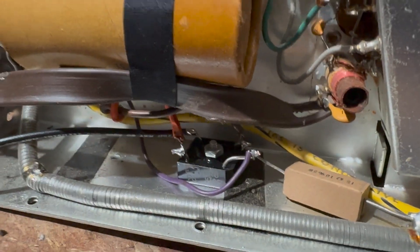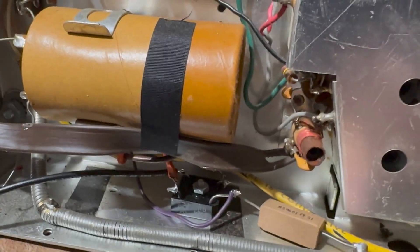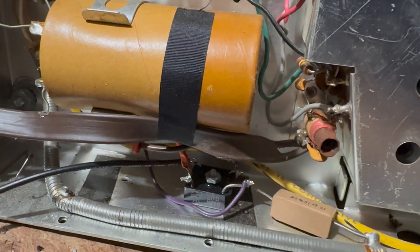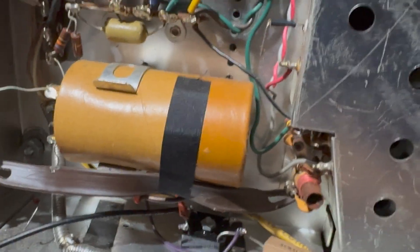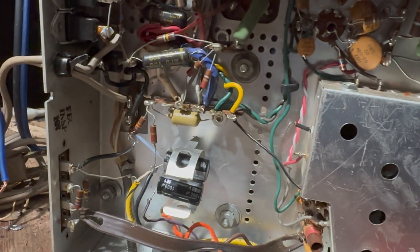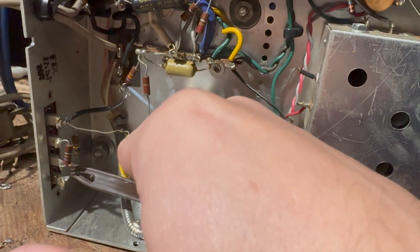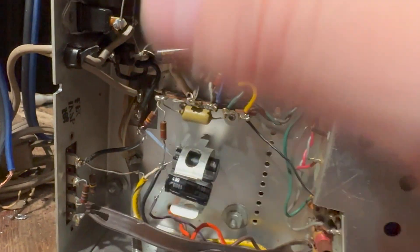I went in here and replaced the negative supply rectifier. I labeled it — it should be connected the right way. Positive goes, ultimately, to ground through this resistor. Then negative goes up to the negative of the power supply capacitor for the negative power supply. That's going to get replaced with individual capacitors in a moment. We've got our rectifier down here, filter capacitors, and then it goes up to the negative supply. The white wire goes up to bias the tubes, coming up right here.